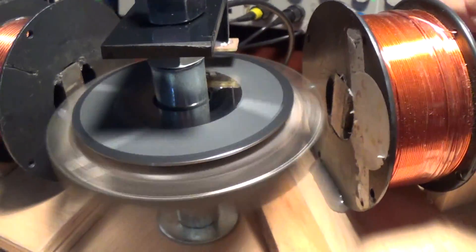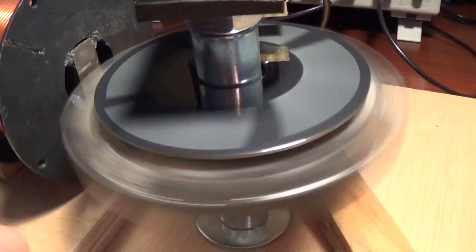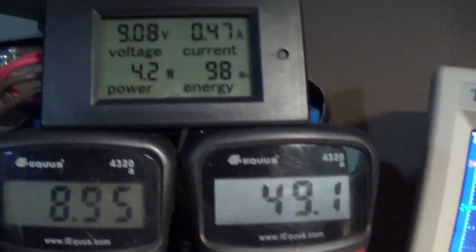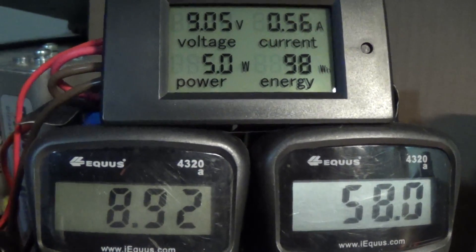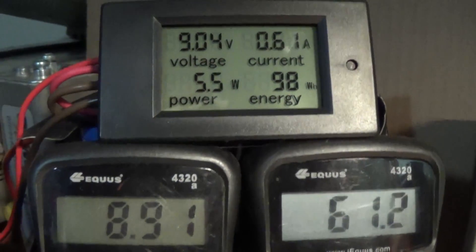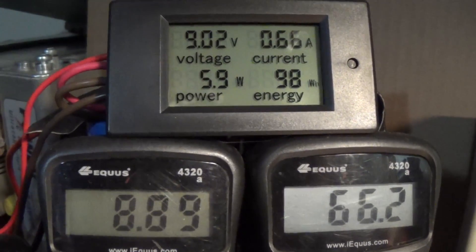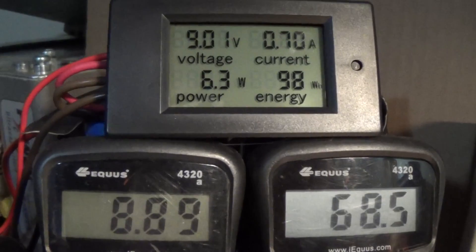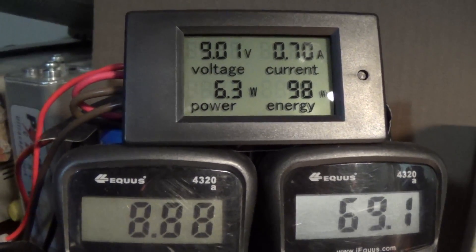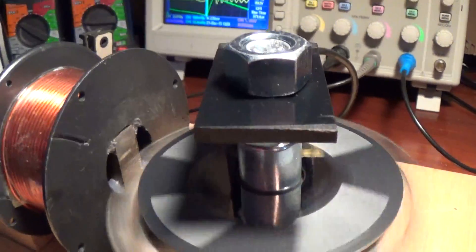What I'll do now, like I did before, is I'm going to take the assist coil away. Assist coil is away — the rotor is decelerating greatly. The current is going up, and as you can see on the meter, the watts are climbing. We are still not yet at the bottom end of all this — it will pretty well consume double the wattage and drop to half the RPM. There we are at already over 6 watts of input, and that's what the primary coil can do on its own, probably because of that very small pulse width.